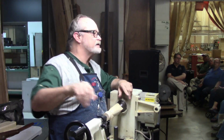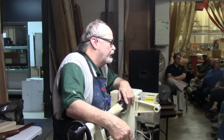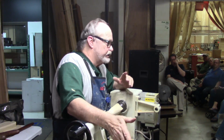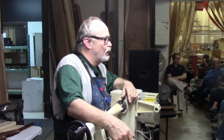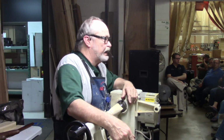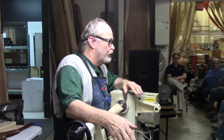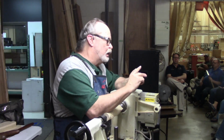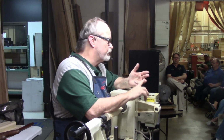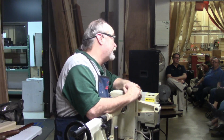Then if you get into these exotic steels like powdered metal M4, A11, D15, 2030, 2060, they're high-wear steel, so guess what? The burr stays on a long time. So the real answer is note when it's starting to dull and don't screw around. Pull up a new burr. But I can, with a burnisher, produce large burrs, medium burrs, and finished burrs. How big did that feel? And that's a big one.